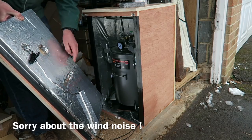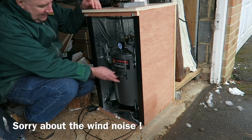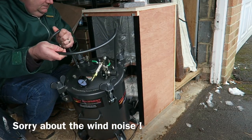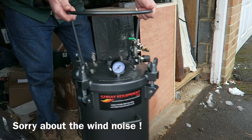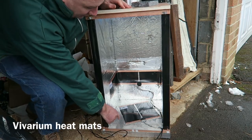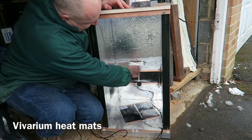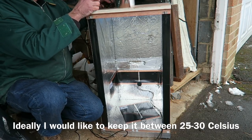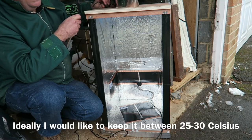Inside over the pressure pot - which I can move out of the way - there we go, feels nice and warm. We've got these vivarium heat mats - these are very low wattage, I think that one's 11 or 12 watts and that one there is 22 watts. It's cut out for the handles of the pressure pot and it's just enough to bring it up to the right temperature. I've put in a little vivarium thermostat - mainly it won't work so well at this time of year, but perhaps in the summer it'll stop it getting too hot.